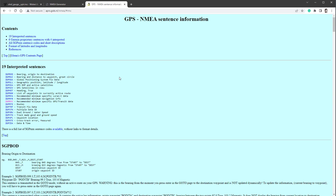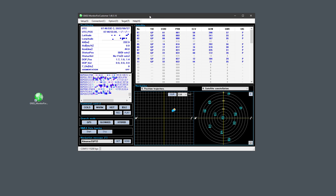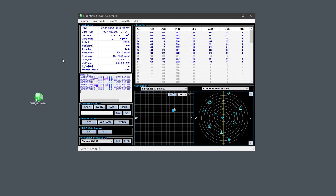Let's talk about the different NMEA message types. There are many listed, but we don't get all of them from our GPS sensor. What we get is the RMC message, which stands for Recommended Minimum Specific GPS Transit Data. It has multiple parts: the validity of whether we have a fix, and the current speed — which is 'speed in knots over ground'. We'll have to do calculations to get miles per hour or kilometers per hour. Inside the GNSS tool, under Options and NMEA Settings, you can limit the message types received. Let's select only RMC messages — hit Apply and now we only see RMC messages in the output.